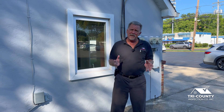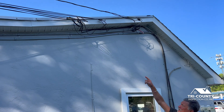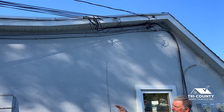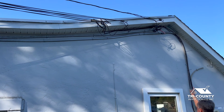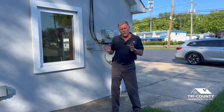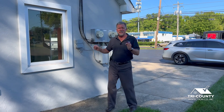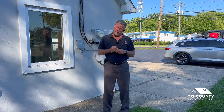I'm starting outside here at Tri-County Inspection because I want to talk about this aerial service. That's a three-wire line that gets connected here. Because of the generator, we ran two lines down into a control room, fed the generator, and then came back here and fed these meters. Now this office supports actually three suites, so we have to have disconnects out here. But once your main disconnect is wired, anything beyond that now becomes a sub panel.